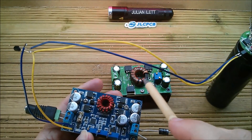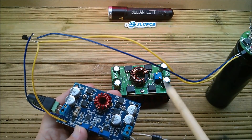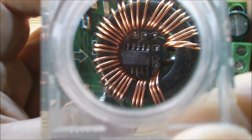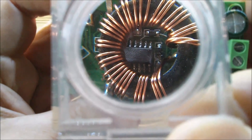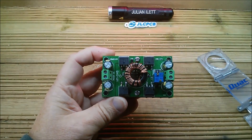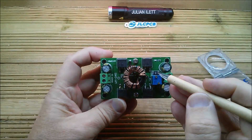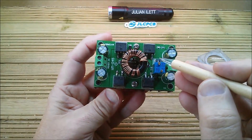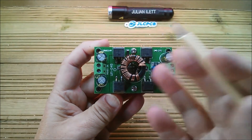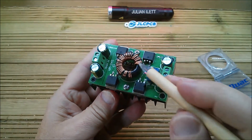But it's not the same chip. The chip has been ground — you can't really see anything on it apart from possibly '46'. I don't know what it is. The other interesting thing is there's no op-amp, so it's obviously measuring the small voltage on that current sense resistor, but it's not multiplying it up — that must be done in the chip. Is it a special purpose chip? Because a microcontroller wouldn't have enough gain on its ADC to measure that tiny voltage.